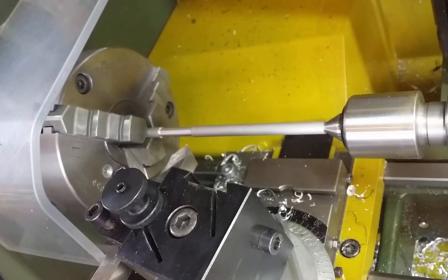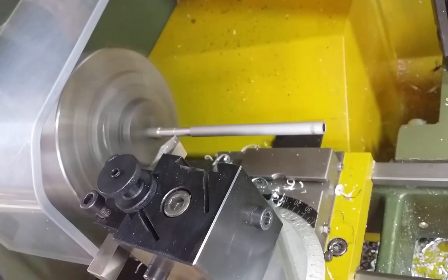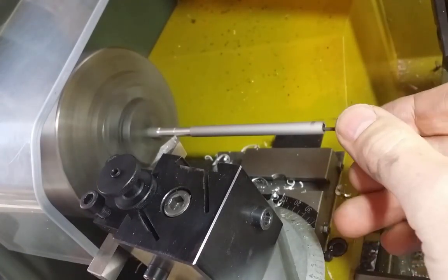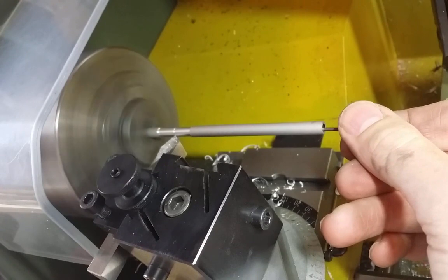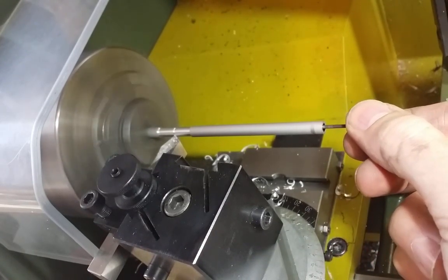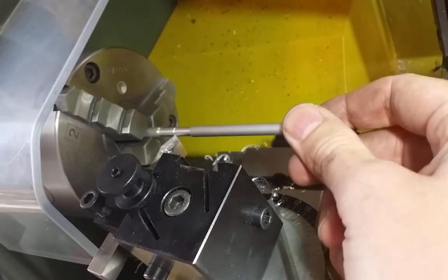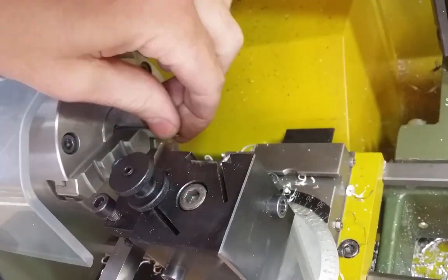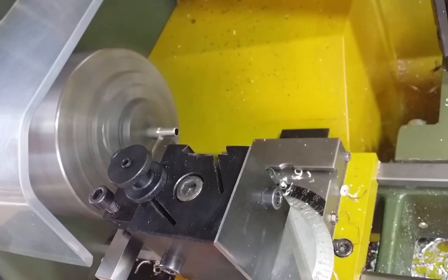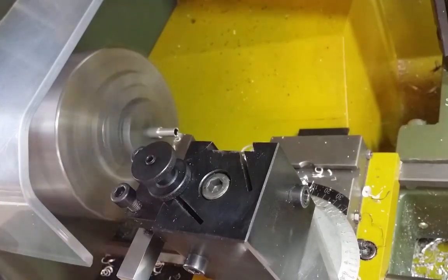Then I cut the dipole antenna in two here. That's because you need to do that in order to connect the cables later. These two must be separated electrically. So after I mount the plastic piece later on, there will be a small spacing between these two pipes. Some final trimming on the ends. Yeah, that is nice, right?